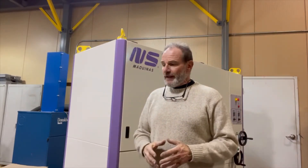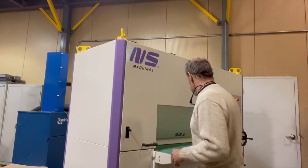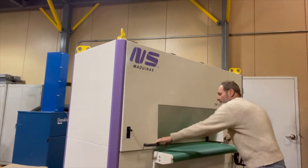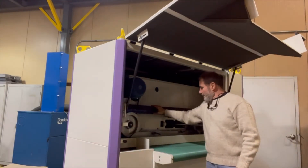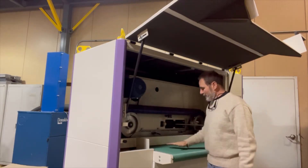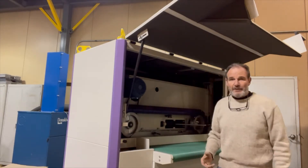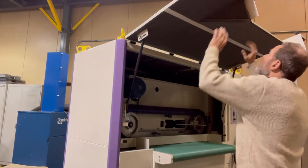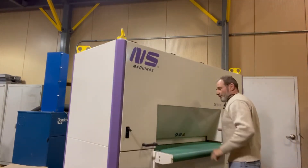Today we are going to run stainless steel — a very simple application on the DM1100C cross-belt machine, which has just two cross belts. One in the front runs right to left, the back one runs left to right. You set the table height for material thickness and the carriage height for grinding pressure. But before we do that, I want to tell you two things.